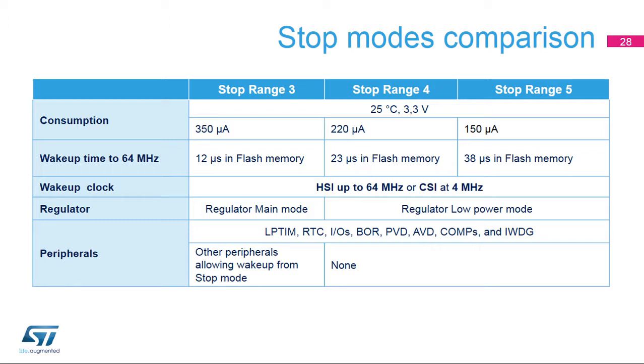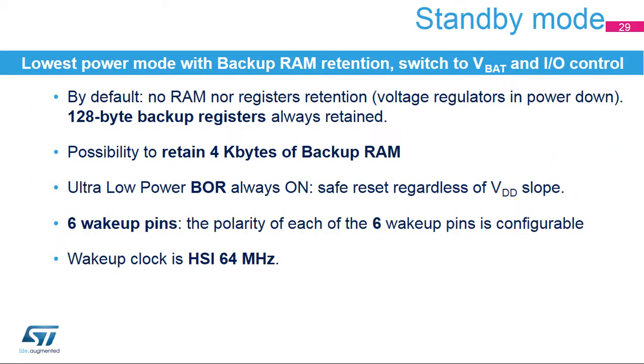To reinitialize the clock system by a master CPU when exiting stop modes, the stop-hold function holds the slave CPU until the master CPU has reinitialized the system. A slave CPU wake-up from stop mode interrupt will hold the slave CPU and wake up the master CPU with a wake-up hold interrupt. Once the master CPU has reinitialized the system, it clears the slave CPU hold, after which the slave CPU will receive the initial wake-up interrupt. It is possible to wake up from stop range 3 with peripherals supporting wake-up from stop mode: UART, SPI, I2C, and LP-TIM.